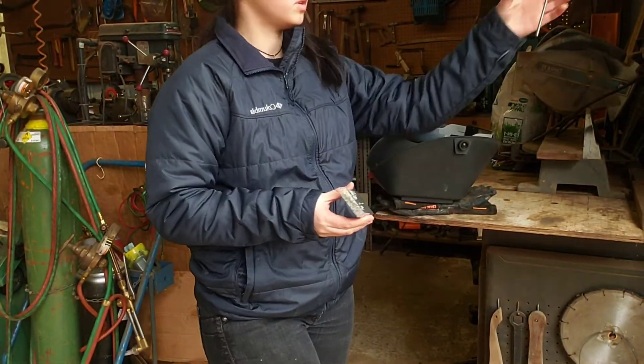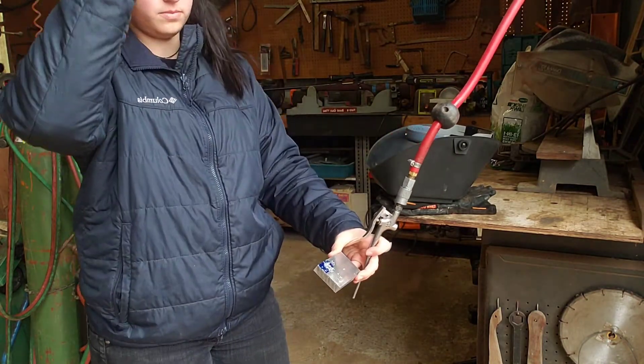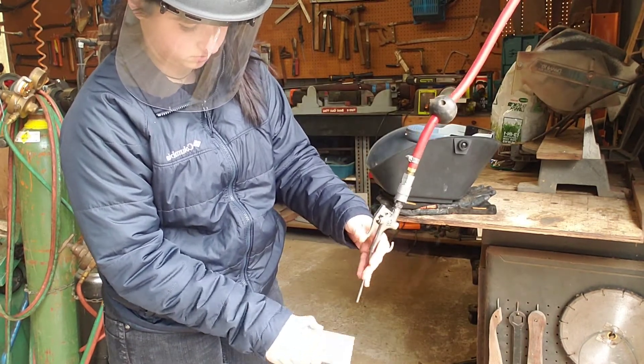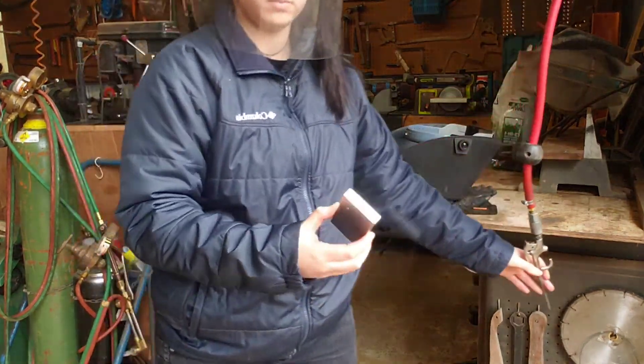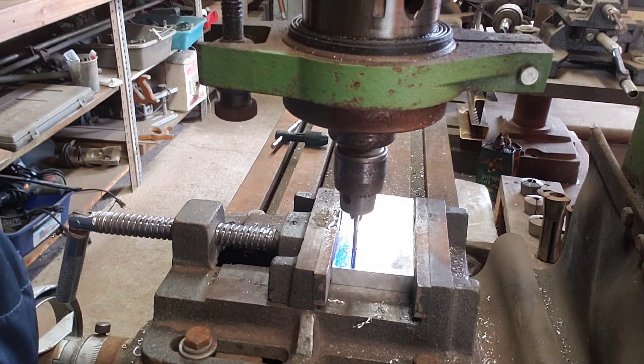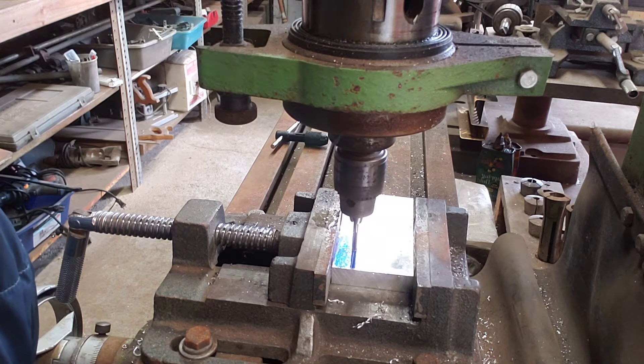This was me taking out the piece of aluminum. I realized after the fact that I probably should have just left it chucked between drilling the pilot hole and actually starting the drill and tap — but, hindsight. So now we're back on the mill, back realigned, and I am manually starting the threads for the actual screw.